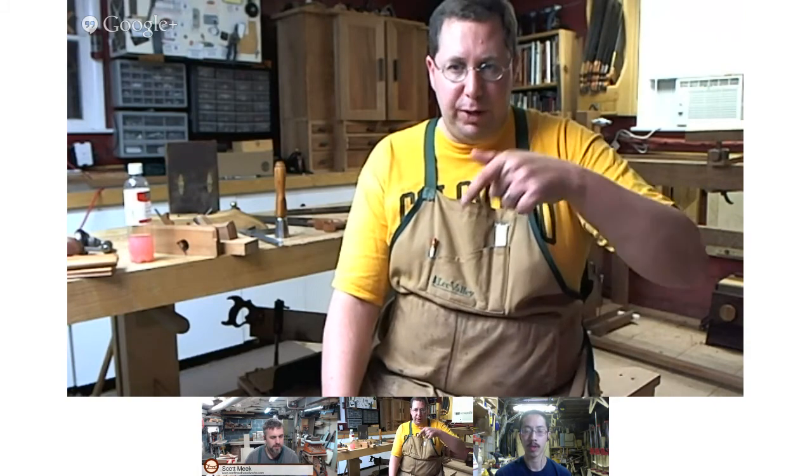I don't know if you can run your finger over it and feel, is there actually a deformation there, or did it just discolor it a little bit? Well, it could be too. I work with a lot of woods that have a high silica content, like mesquite or some of the exotics. And if that silica can break down a razor sharp edge of a blade, there's no reason why it can't put a slight, microscopic scratch in the freshly polished sole of a metal body plane. Right. Whether it be metal, cast iron, which is quite soft, or wooden.